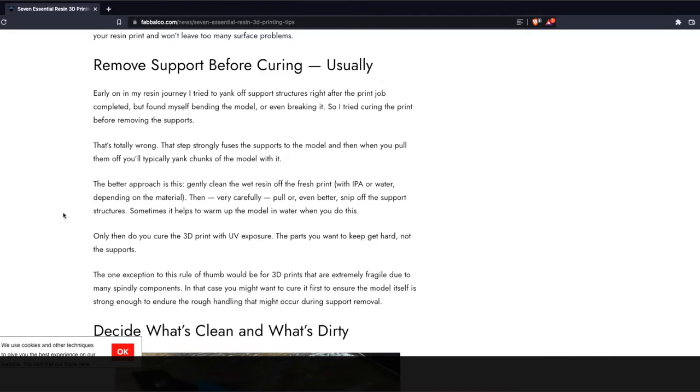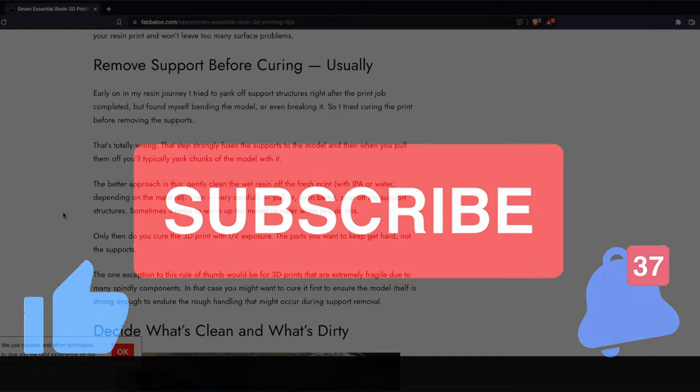If you're looking at hundreds to low thousands in volume, something more like a Soyocast where it's doing silicone molds but actual injection molding. You still need to use the regular processes we've always had. 3D printing will get faster over time and more distributed, but there's always a place for injection molding, a lathe, or something being machined — it's just a cheaper option. It is lower cost per unit; you just have to hit a certain minimum unit count to make it economically feasible.